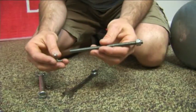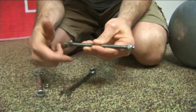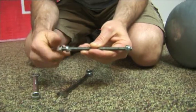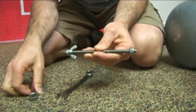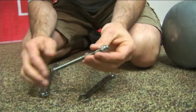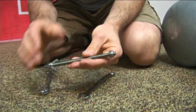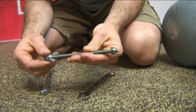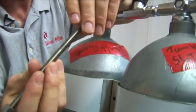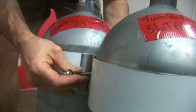In the bolt kit you've got a threaded rod and a lock nut. The easiest way to get the nylon lock nut on is to screw on your wing nut backwards. Put your standard screw on, hold it with the wrench, and then twist your nylon nut on to the appropriate length. You don't want to leave too many threads exposed on the back end — that'll give you enough length to put your wing and your plate on. Now take your threaded rod with the lock nut on it, put a plain washer on it, and stick it through the hole to the front.